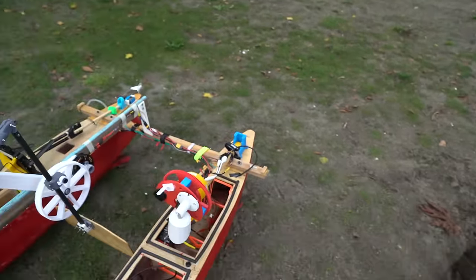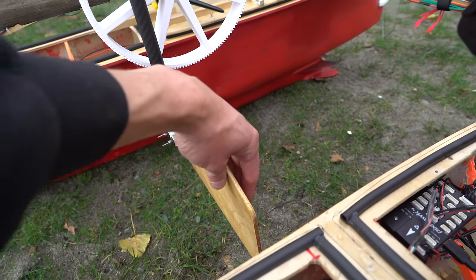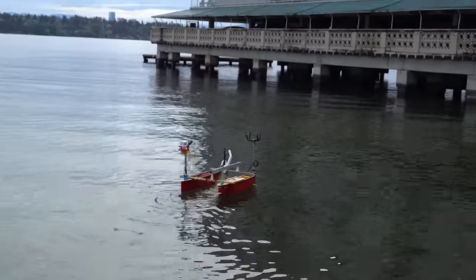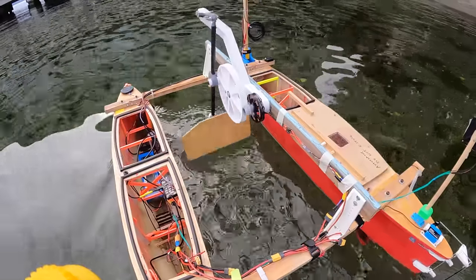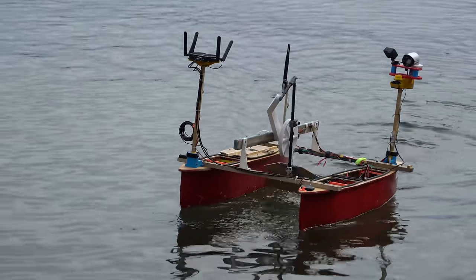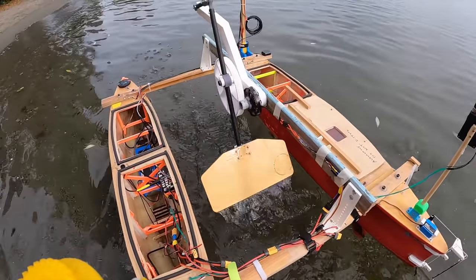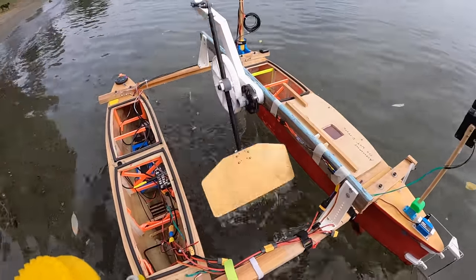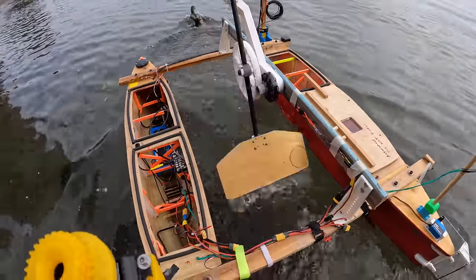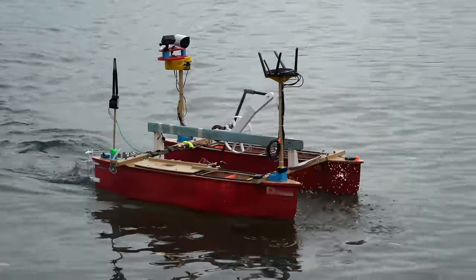As per Colin's idea, I integrated a flapper — a little pivot hinge — onto the paddle. It cannot pivot on the power stroke, but it can pivot on the return stroke. With the hinge installed, the paddle would just fold back when it entered into the water. This could also indicate that the paddle is mounted a bit too low. At higher speeds, the paddle would be folded during the entire return stroke and wouldn't even have a chance to straighten out before entering the water. I tried more rubber bands to stiffen up the hinge, and that seemed to help a little bit, but you can still see the paddle pivoting on entry.